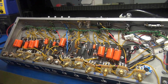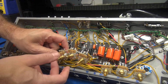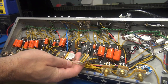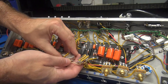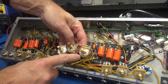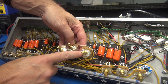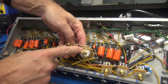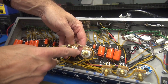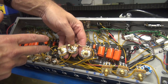A lot of people call me out on this, so I'll leave it up to you. You're grounding to the back of your pots like this, with a ground runner. Now look at the other side of the pot — this dust cover is held on by four bent-over tabs. And yes, there is a lock washer that goes on the brass shaft to the chassis. So let me ask you: is that a good ground bonding system to the chassis?